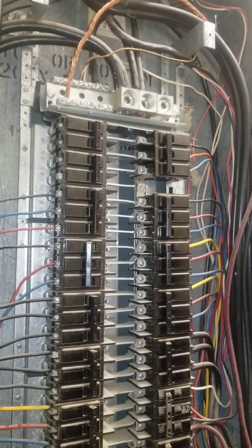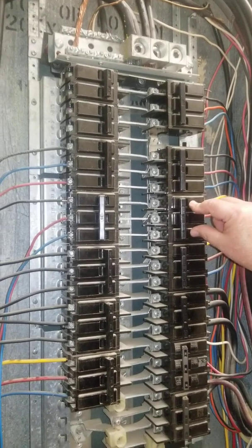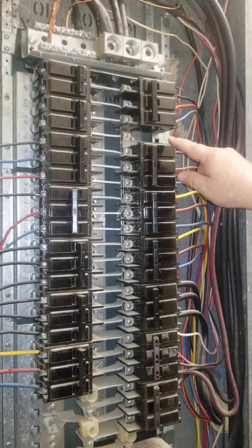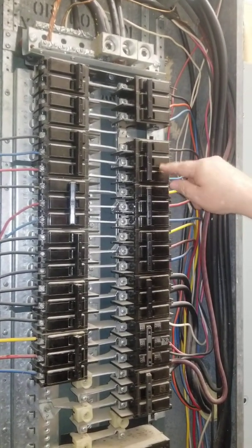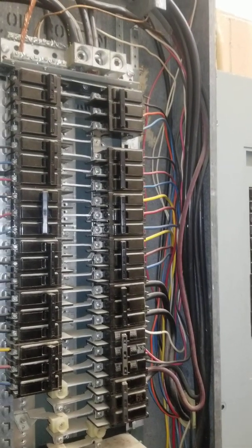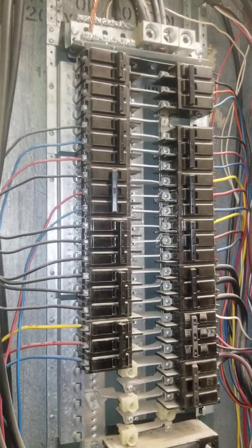Will the amperage go up because of that? Amperage will go up a little — not enough to hurt anything. There's no way that you can put these breakers in wrong. See how that one's got a single? That's a good example right there. It's a three-phase breaker, but you're still picking up all three phases — seven, eight — you're still picking up all three phases.